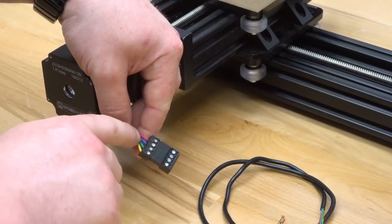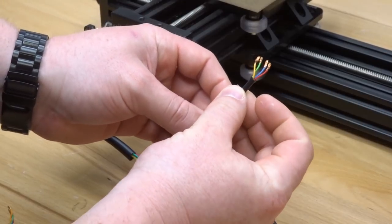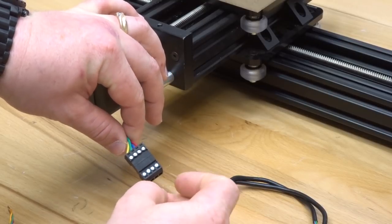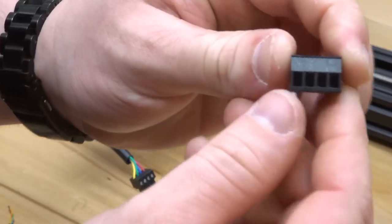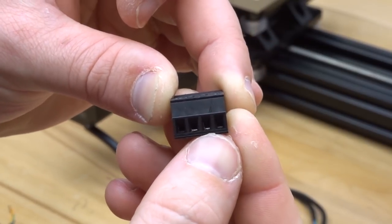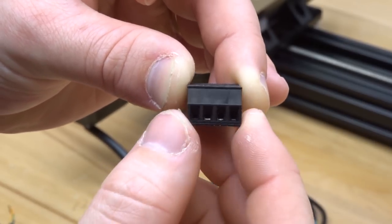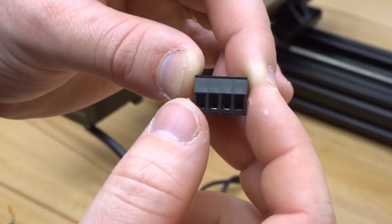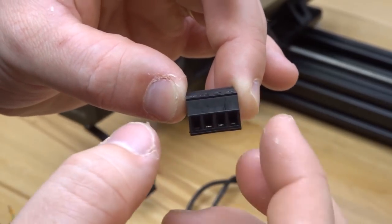It's a plug-and-play system, and what's really easy about this is we're just coordinating the colors to each connector. On this four conductor wire you'll see the same colors: red, blue, green, and yellow. Coming to the connector, we're going to loosen the pins on top and insert the wire in the order shown. It's very important to loosen those pins before inserting the wires — sometimes a wire will stay in giving you the illusion of connection, but it's not actually secure. Loosen the pins, insert the wire, and tighten back down.